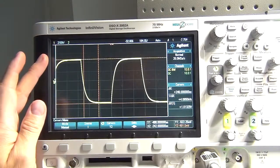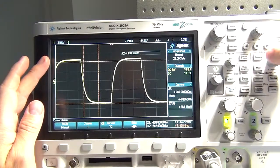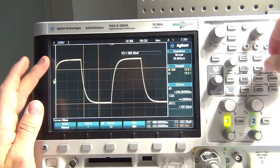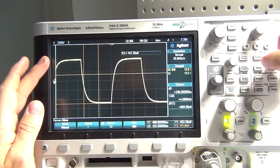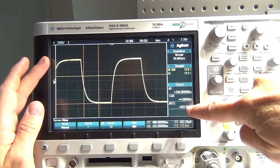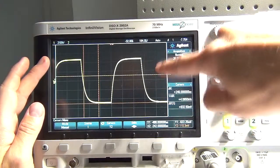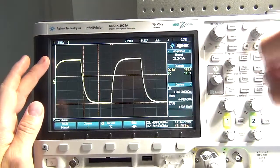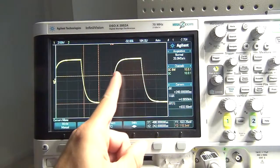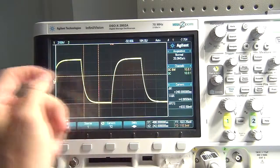So to get that figure, because it's now straightforward, it's 1 volt, I have to move down to about 632 millivolts. So let's bring it down. Okay, I can only go to 632.5, but that's fine, because 632 is 63.2% of the total. That makes getting that calculation easier. That gives me the point on the wave, according to that constant that you have to measure to. So you're going to measure your time period up to that point to get your time.